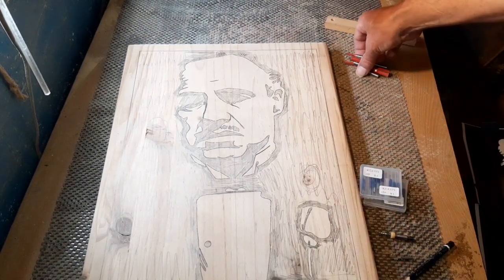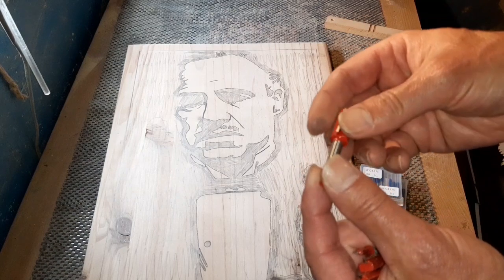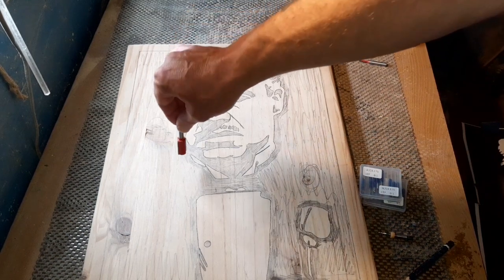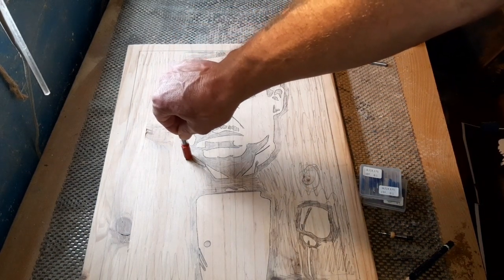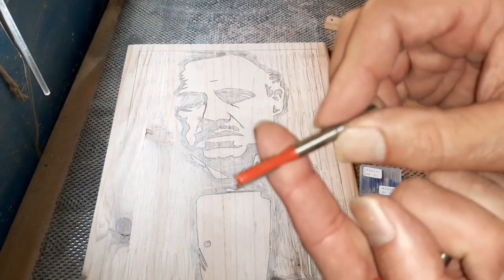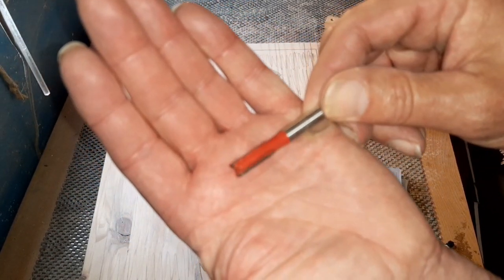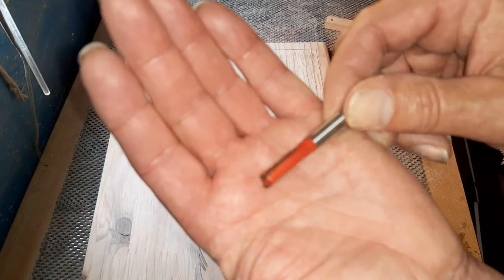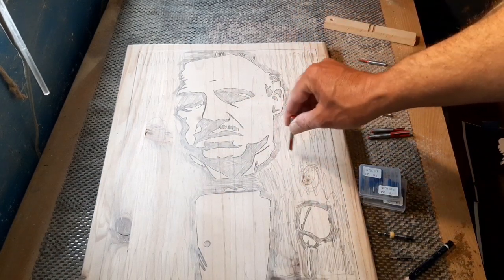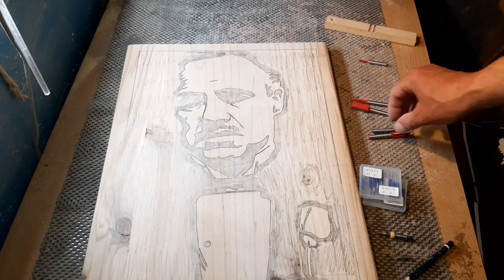If it's not coming out as quick or as nice, I use these straight flush bits. These come with a quarter-inch shaft, so no adapter needed. They're quite aggressive — if you go near these small areas with a big one, it will snap that section off. So you want to come down a little in size, and a double-bladed one is ideal. We'll pop that on later in the video to remove all the outer sections.